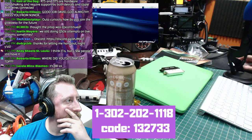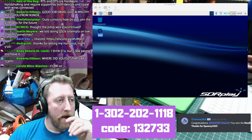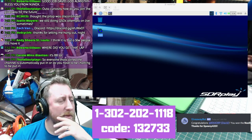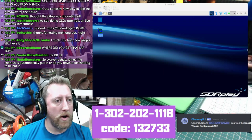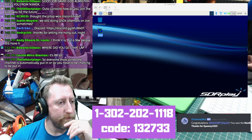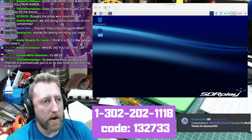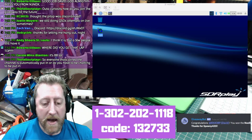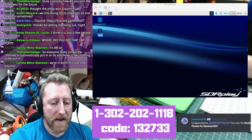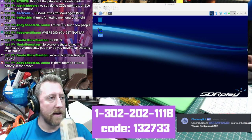You said you prefer the NooElec SDR to the RTL. Mm-hmm. I was just curious, why do you prefer that one? So, in my experience, when you want to run the HF frequencies, in the direct sampling mode or something like that, the NESDR seems to do better than the RTL-SDR. That's really all it's about, trying to get as much HF juice out of it without having to run an upconverter, although most of the time you need to run an upconverter. And keep in mind, the upconverter that's available on Amazon is made by NooElec. So the NooElec company makes the upconverter. I guess so. They probably have more experience with that anyway. Yeah, exactly.